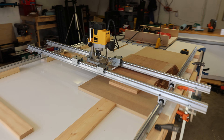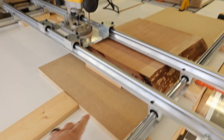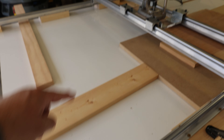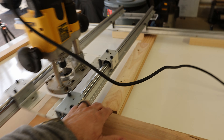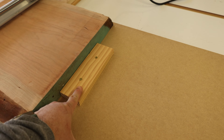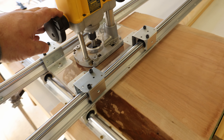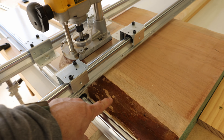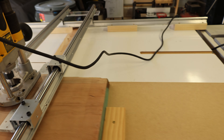The next thing was figuring out how to attach all of this to the table. I thought about drilling holes in the tabletop but they would be permanent. Attaching the rails directly to a piece of 2x4 would cause the 2x4 to move and start binding. So the alternative I came up with was to cut 8-inch strips and attach them to different sections of the rail. This allows for wood movement and I can leave them on the rails permanently — whenever I want to set things up I just clamp it to the table. We used the existing holes and took some deck screws that wouldn't go through the 2x4, attaching them in four different locations for each section.